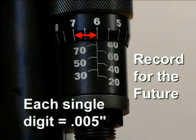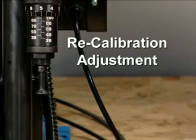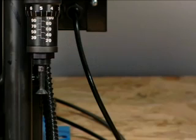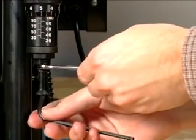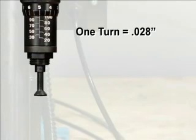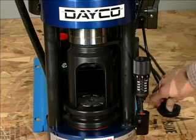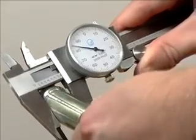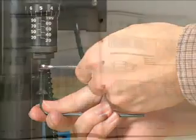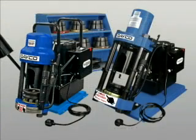Adjust the gauge until the problem combination is in spec, and you may want to record this new setting for future reference. If all your hose and coupling combinations show an identical error, then your unit needs recalibration. The recalibration adjustment is similar to the one described after the initial calibration check: hold the micrometer barrel with a five-sixteenths wrench, then rotate the stem with a five-thirty-seconds hex key. One turn of the stem is equal to approximately twenty-eight thousandths of an inch. Rotate the stem clockwise for a tighter crimp, or counter-clockwise for a looser crimp, then crimp another hose and make four measurements with calipers and average. If the crimp is still out of spec, repeat the procedure. Remember, your Deco Hydraulics catalog is a valuable source for information on safety, hose selection, and preparation. With responsible operation and proper maintenance, the Deco D165DC and D206DC crimpers can provide years of trouble-free service.